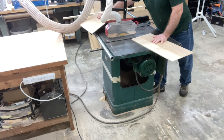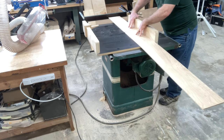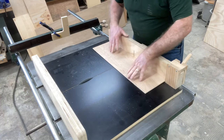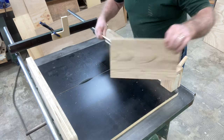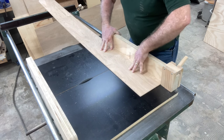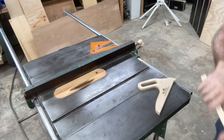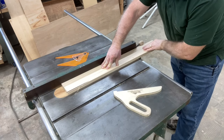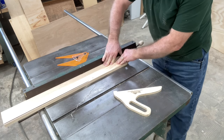If it wasn't for the fact that this plywood is so thin and lightweight, which is the requirement for these boxes, I would not need a special joint to make these. Because it's not just a simple matter of gluing these edges together — the box literally would fall apart. I want to get all of these cut to length and then make the little gusset to hold these boxes together and give enough gluing surface to securely hold the box. Now granted, I could use other types of joints, whether it's box joints or whatever, to hold it, but I have not shown this method before.